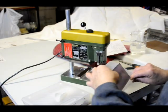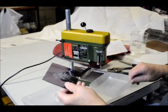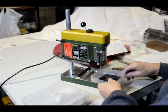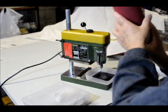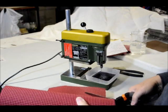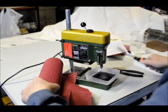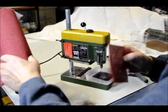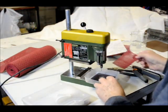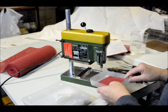You're going to need a plastic tub — cut it down, you don't need it really high. Put a piece of window glass or stained glass in the bottom of that tray. Then cut a piece of rubber shelf paper — it works wonderful — and that goes on top of the glass. So you have the tray, the glass, and the rubber shelf paper. This cushions the shock of the drill on the glass.